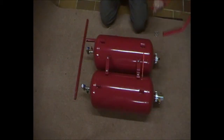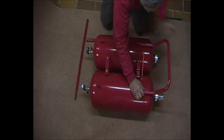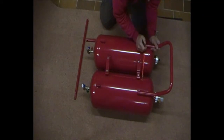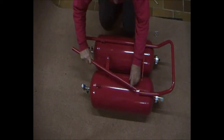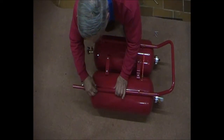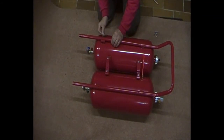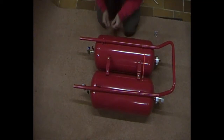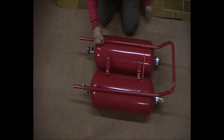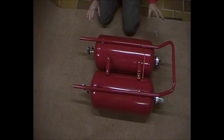The tanks come already pre-assembled so you have to spring into position the carrying movable handle. Put it just in approximately to start with, and then you attach the chassis rails that go inside those, and you then have to align the holes for the brackets. They come with these bolts — you put them in place. They supply washers but they are very thin washers, so I've used some inch mudguard type washers to spread the load and make it more of an engineering job. You eventually put all of those in place and then carry on to the next stage.